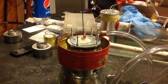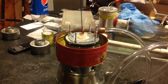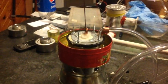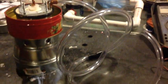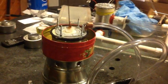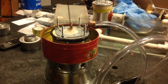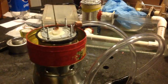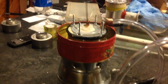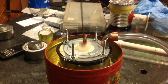This is my next project. It's a Stirling type engine but it's a metronome. Basically what's in it is a displacer piston and then there's a hose that has to be tuned — a certain length and a certain size — and it works as a piston, what they call a gas vacuum piston. The air goes out and then it takes a few seconds to turn around to come back, and that creates enough vacuum and pressure inside the main cylinder to lift this diaphragm up and down just with the displacer piston in it.